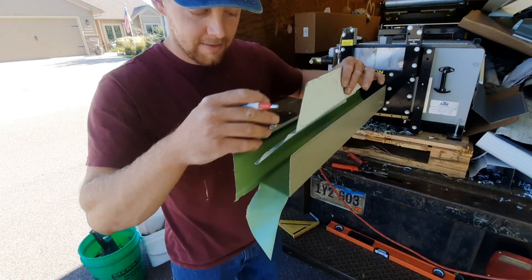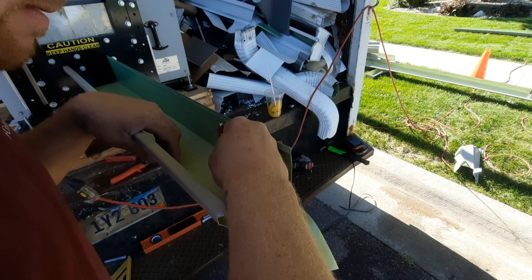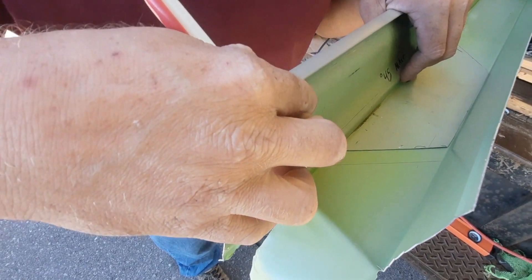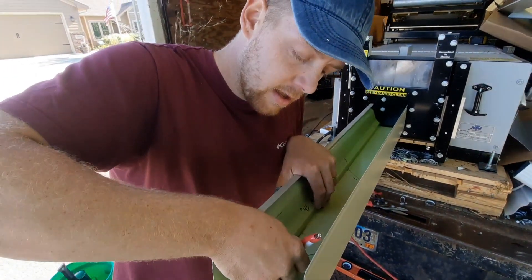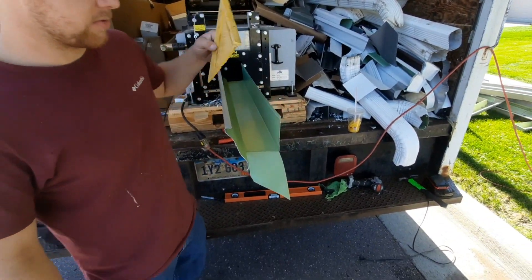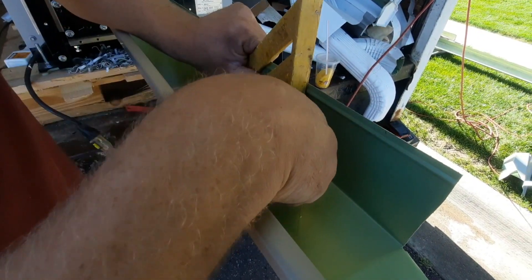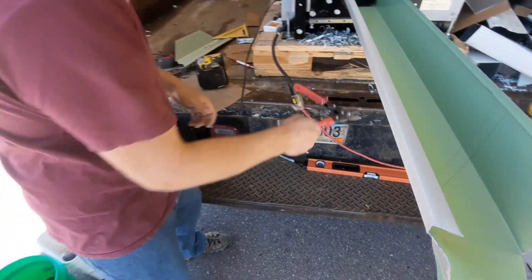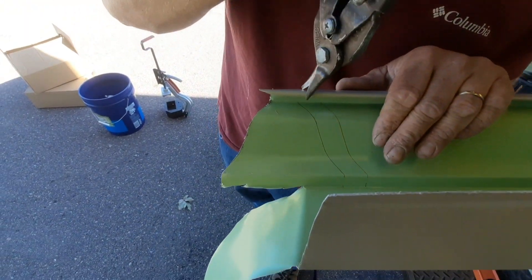My cut's jagged from my last miter. Pop this in here, we got an outside miter. We're going to make one mark, one up the side, then slide about a half inch over — whatever you want, sometimes people like bigger or smaller tabs. Grab your square, put the flat side in there, go right to your line, line up the other one. Take snips — I usually start it right here so I don't have to cut this top.